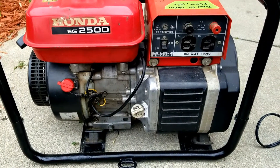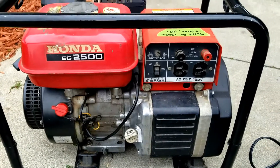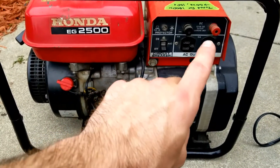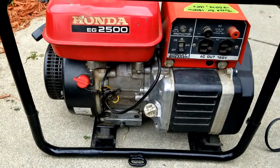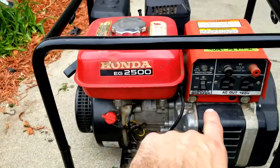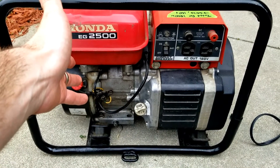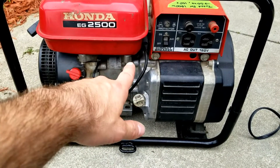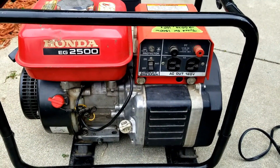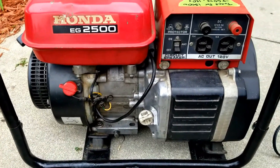For instance, most electronics require 60 Hertz and 120 volts. If you have this tuned so that at idle you get 60 Hertz with no load, you get 60 Hertz and 120 volts. The minute you put on a load — say push two sides of the toaster oven down, which is about 1500 watts — you're going to see this drop down to about 55 Hertz, maybe even lower, 53 or 54. And you're probably going to see the voltage drop down to about 115. So for that reason, we set this a little higher initially based on the load you're going to put on it.